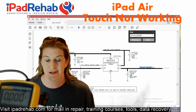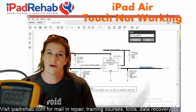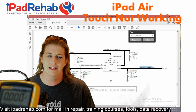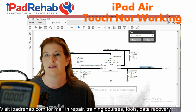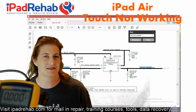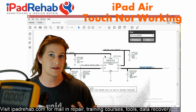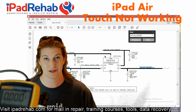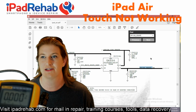It's one possibility. The other possibility is that the PMIC is supposed to always put out that voltage, and the control actually comes here at this chip, and therefore it's not putting out that voltage when it should. We don't really know the answer right now, and we may not be able to find out, because that's going to involve getting into things we don't have a mechanism to learn about. What input to the CPU is required in order for the CPU to tell the PMIC, go ahead and output that signal to turn on the touch system? We don't know. So sometimes we run up against a wall of what we can and can't figure out just using logic.